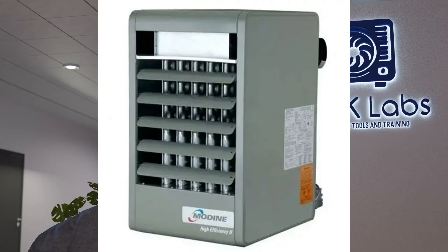A radiant tube heater is the better option, and here's why. If you have a unit heater or a heat pump in your garage, it's conditioning the air. Your garage isn't very well insulated — usually no insulation in the attic portion, and not much on the garage door itself. If it's a two- or three-car garage or larger, that's a lot of heat loss, and it's very drafty no matter how well you try to seal those garage doors.